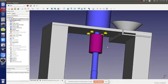It's a small motor with a half inch shaft and a keyway on it, so ideally you'd have something like a half inch coupler to whatever the shank is. What I would actually do is take a socket and a half inch coupler and weld them together. And there you go. So no machining.